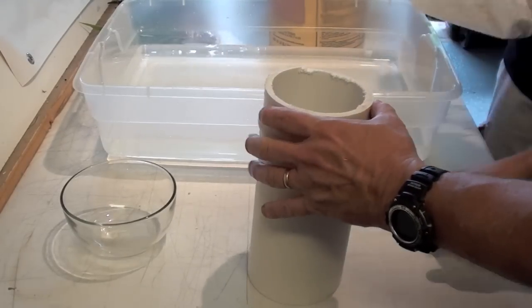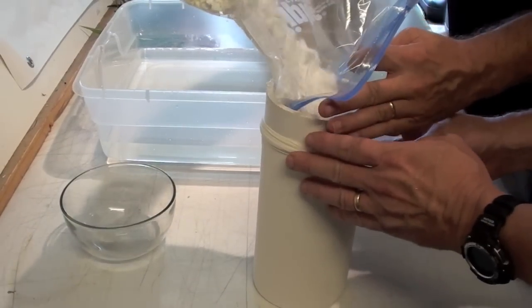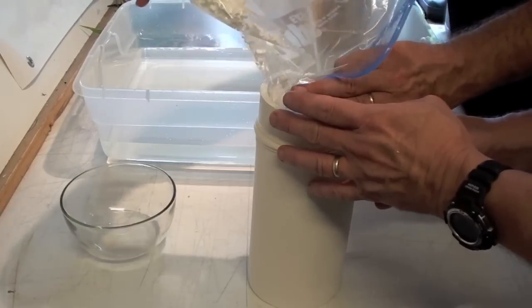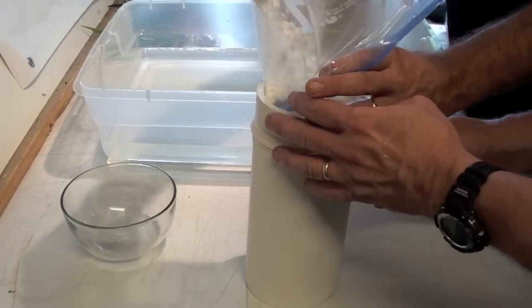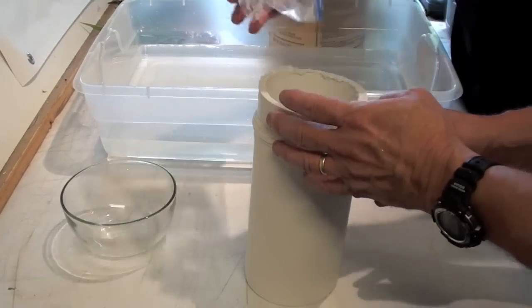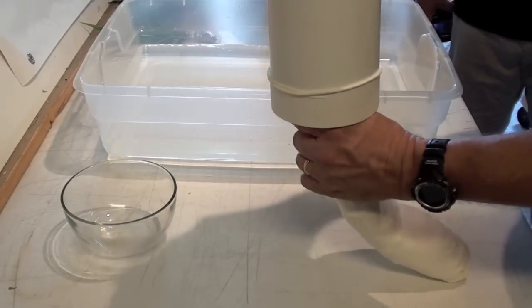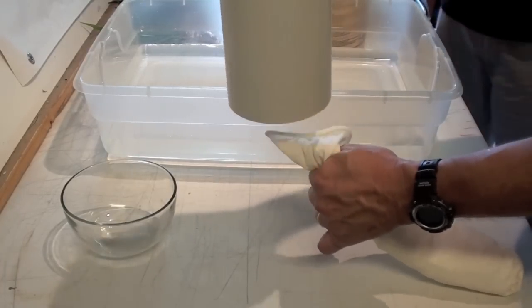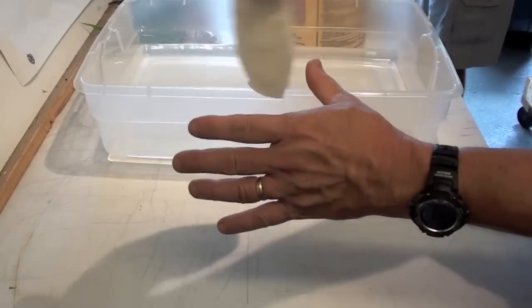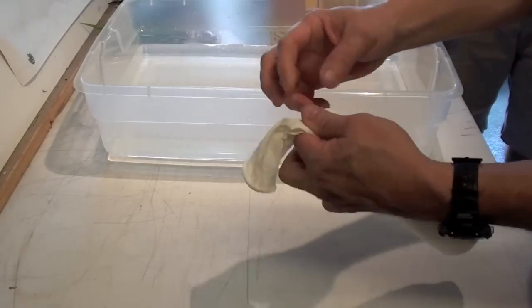Once the oil comes off the plants it'll enter your water. This can easily be cleaned up with our Micro Bond Optimal Oil Petroleum Sorbent, otherwise known as OOPS. OOPS is a white foam polyester sorbent material that instantly bonds and reacts to the ions of hydrogens in the hydrocarbons. Here we are making a simple sock with it — it comes as a loose product or in sheets.